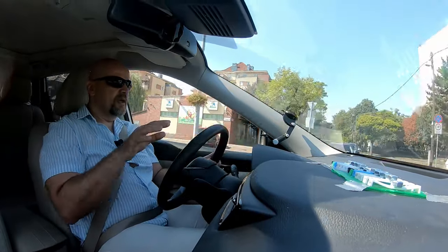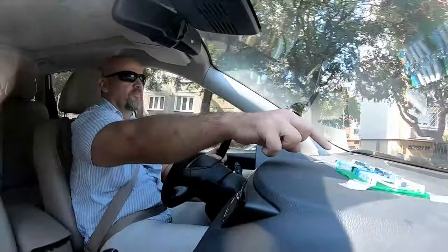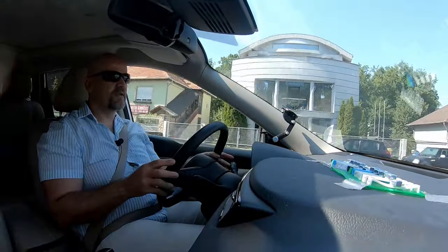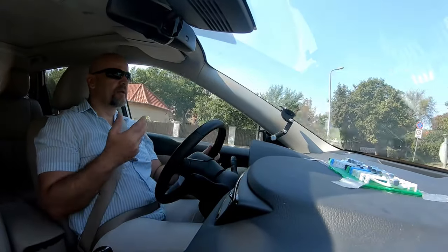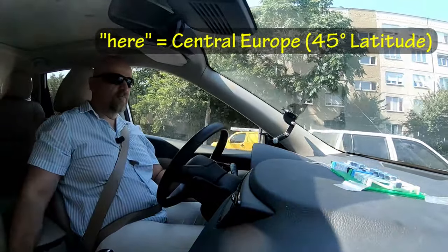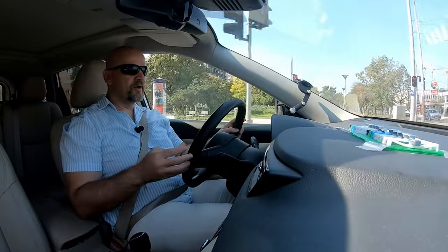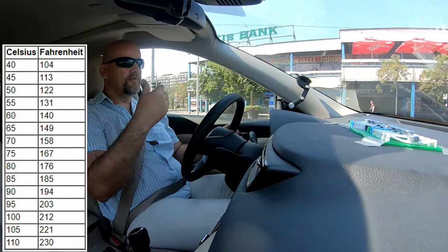So I decided to create my own test. There will be 10 very hot days in a row and this test is still in progress — you can see some test probes here. I will test seven different materials, and at the end I will do a test in the oven simulating higher temperatures because I cannot get high enough temperatures here naturally. I measured the temperatures; I even created an Arduino data logger to record the temperature change during the day. Temperature values are in degrees Celsius but on screen you can also see the value in Fahrenheit.